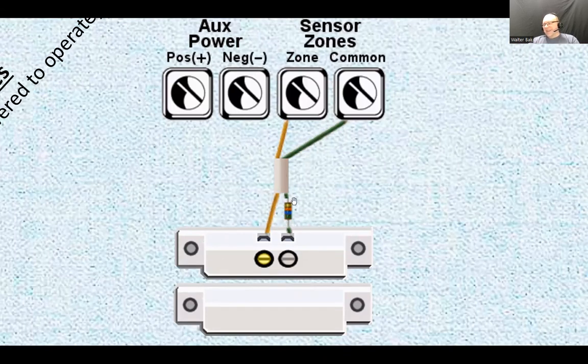Well, this should be outside of that, past that. So you would run a wire past that, close that with the end-of-line resistor, and that's it. Over here you would have the line. We're going to continue somewhere else. The resistor comes back and is connected here. And connected there.